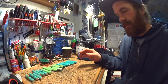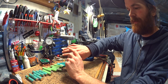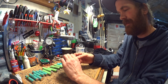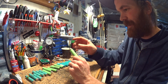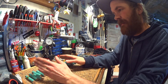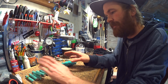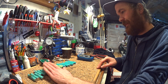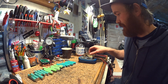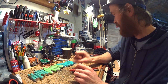So I've disassembled three old laptop batteries. As you can see from my fingers, the soldered-on tabs are very sharp, so if you're going to disassemble these battery units yourself, be careful. I'm going to check the voltage on all the cells and see if any are around 3.5 to 3.6 volts — maybe 3.3 volts is the minimum, I'm not quite sure. If a cell is at 1 or 2 volts it's probably destroyed. I'll read up on testing lithium cells and do further testing with the ones that seem okay.